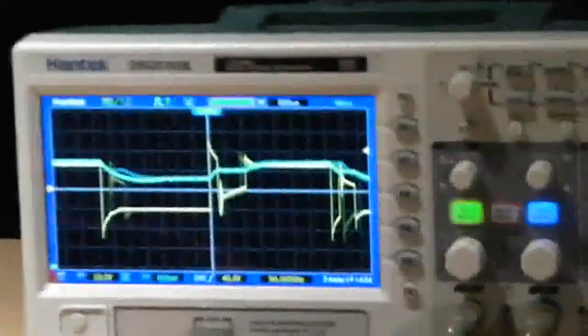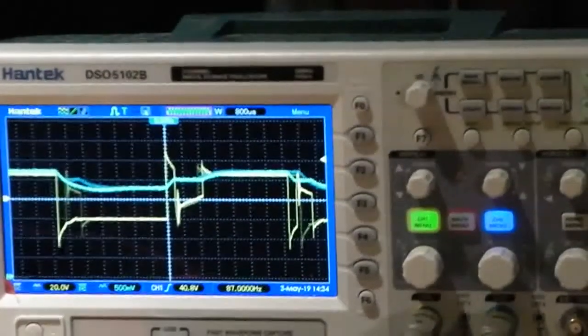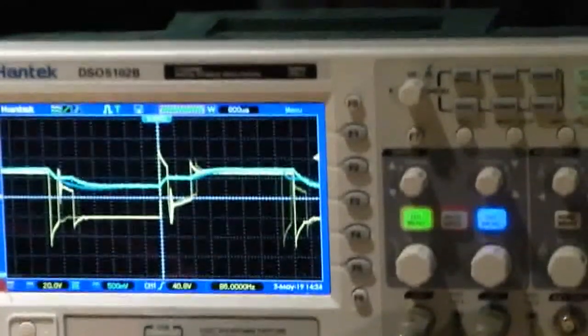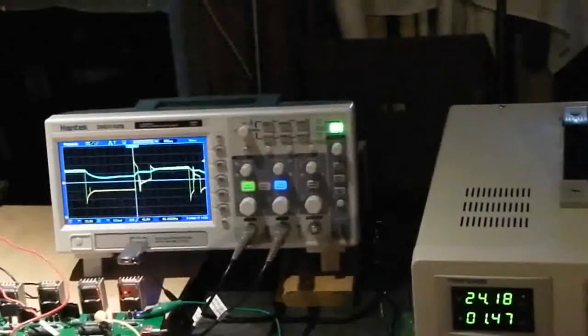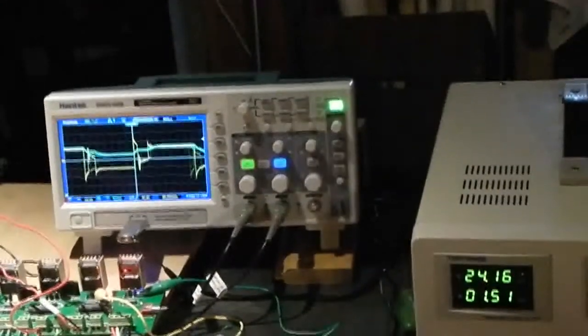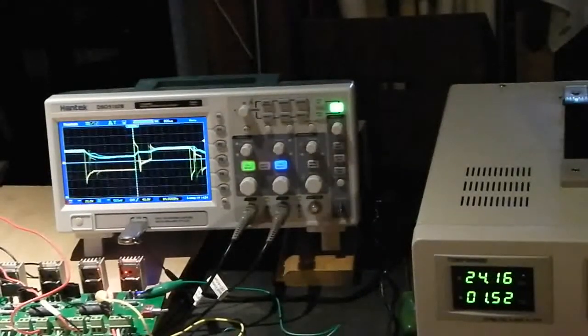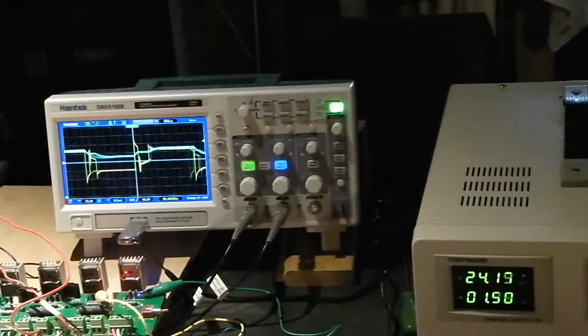The screen displays a relatively nice pattern, showing you we're at about 2400, 2600 RPM. And so we're able to do a cold start, which is kind of impressive. And you can see it's drawing about 1.5 amps at this point. So let's move on to the next one, 36 volts.